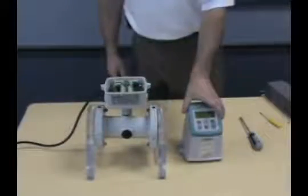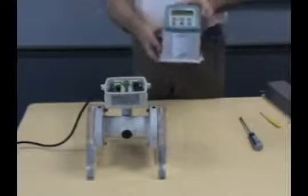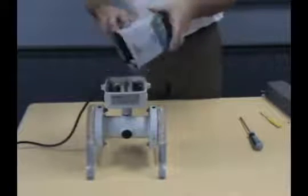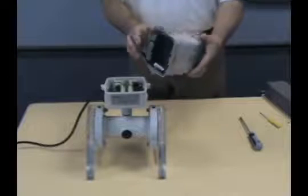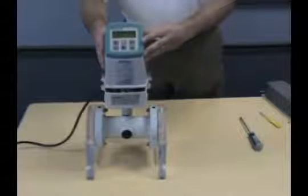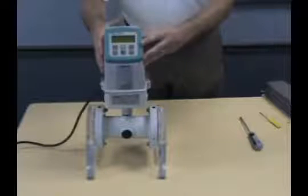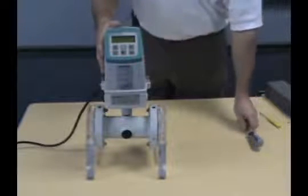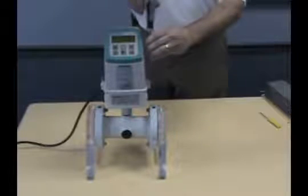The mains power wiring has also been connected and the ground wire is secured to the metal plate on the bottom. The final step is to place the transmitter on the completed wired junction box. Please note the connectors on the bottom will meet up with sockets on the board. Place the converter straight on top of the junction box and press gently down to seat the transmitter.